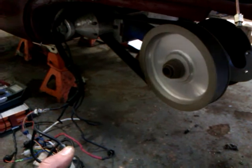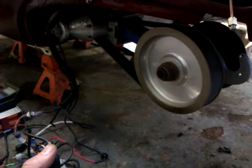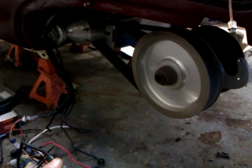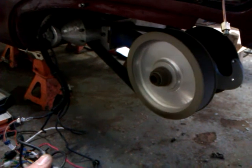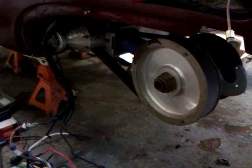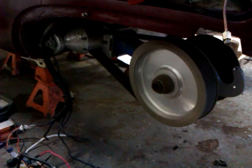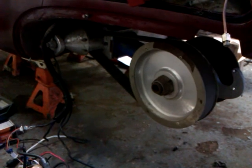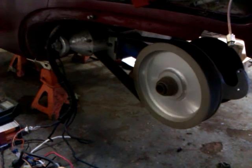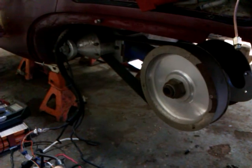We've got some speed control — right down, back up again. So it works. It's not perfect; I think this controller isn't quite happy with the hall position sensors. Sometimes it won't start the motor — it seems to depend on what position it stops in. I'll turn the camera on, though it's decided to behave itself for the camera.